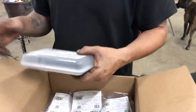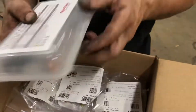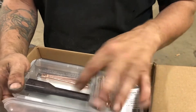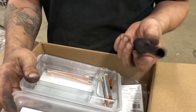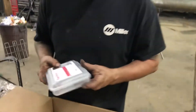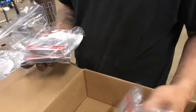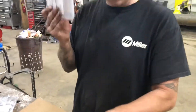This is really what I was excited about. I got to try this out at PRI this year in Indy. This is the high-access consumables kit for the PowerMax. We have super long electrodes, super long nozzles, a Swirl Ring, and this extension that goes on the end of the torch that allows you to get down into hard-to-reach places to get the job done. We'll likely use this today and give you a demonstration on our current project. Along with that are more consumables: the Duramax torch, more nozzles, another cap, and what looks like a drag tip. I still have to figure out how all these interchange — the difference between regular cutting versus gouging, and whether the cutting consumables are different from the high-access ones.